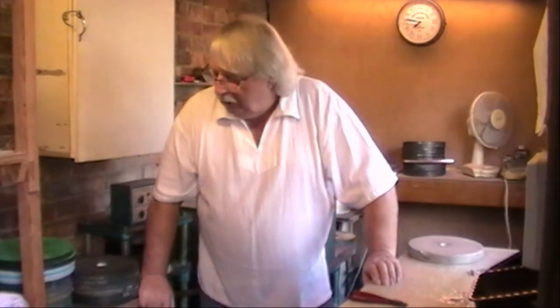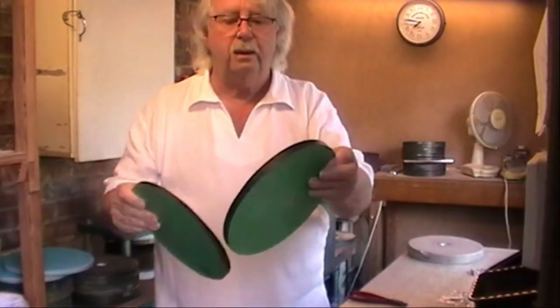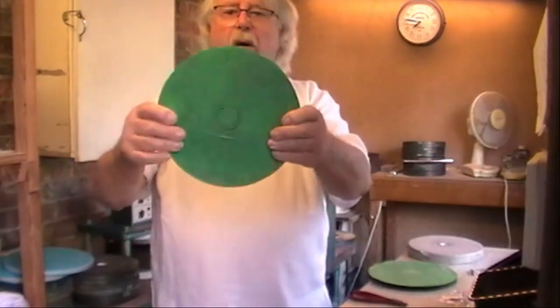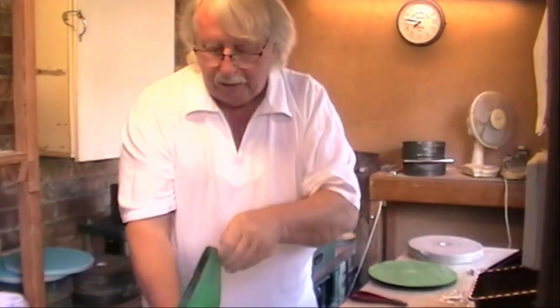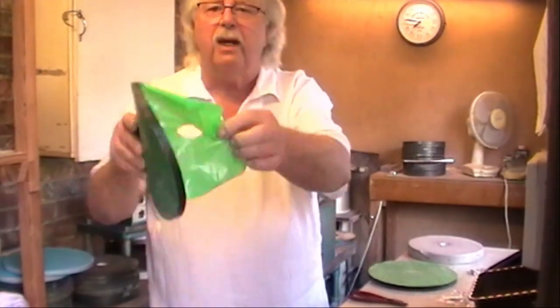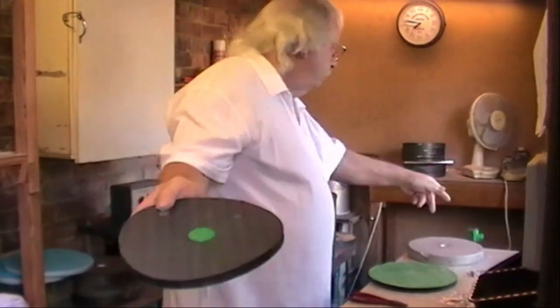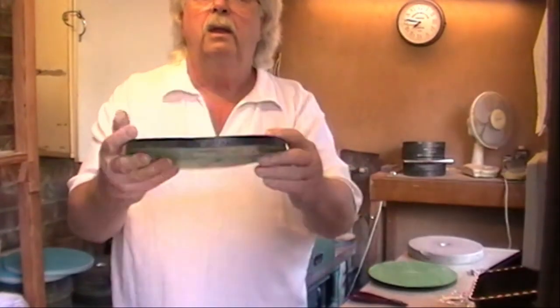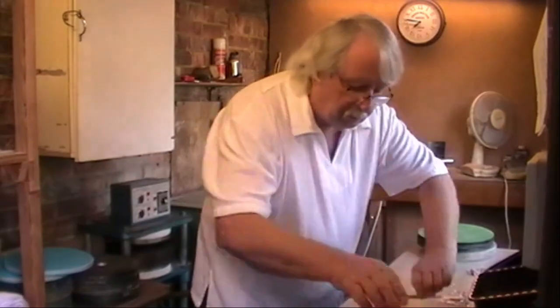So the first process is making a mold from our masters, and we use two types of rubber mold. The first one is a black rubber mold. And that comes in two pieces. You have a top and we have a bottom. And as you can see, that piece there has got to be cut out so that it gives you a hole. And before you do any casting, we peel off our piece of plastic, and there you have your rubber, and you peel both sides of the top, and then